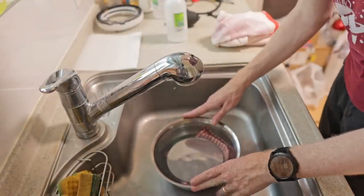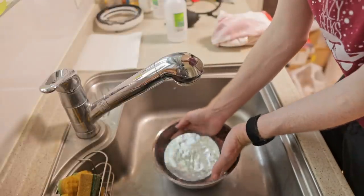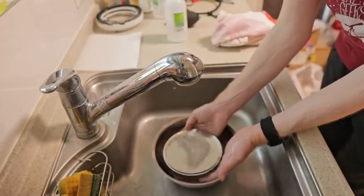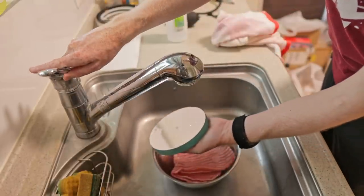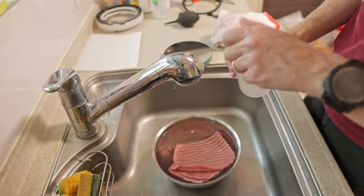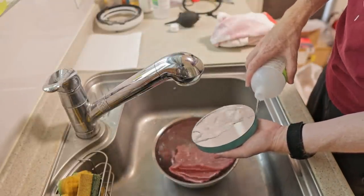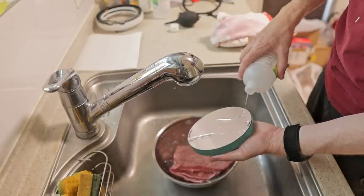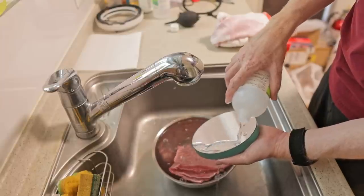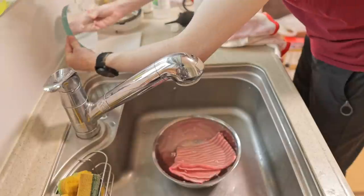Now that I've finished both learning about parabolas and cleaning the mirror with my fingertips, I carefully remove the mirror from the dish soap and water solution. I then do several stages of rinsing: first a rinse with tap water, then a second rinse with distilled water. I angle the mirror a little and generously pour distilled water all over it.